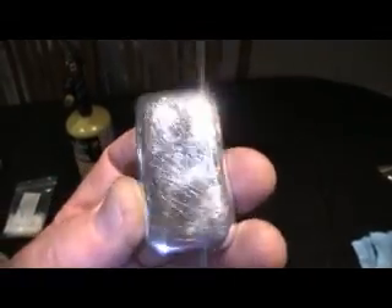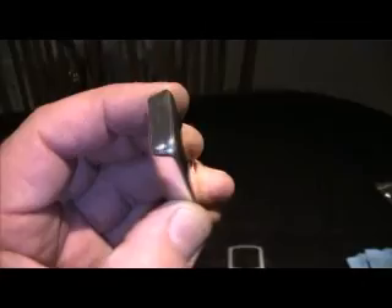I'm quite happy with the way it's turned out. I've managed to get around 80 ounces so far in the bars and I'm working towards getting 100 ounces all up. People might ask what I'm going to do with it — I've actually been in touch with the Perth Mint. They have an assay process. I can pay a $150 fee for a fire assay where they melt the bar down and re-pour it and tell me exactly what it is. There's also another process — I'm pretty sure it's something like mass spectrometry — where I'd drill a hole through the bar, put the drill findings in an envelope, take them to their refinery, and they'll tell me exactly the purity.